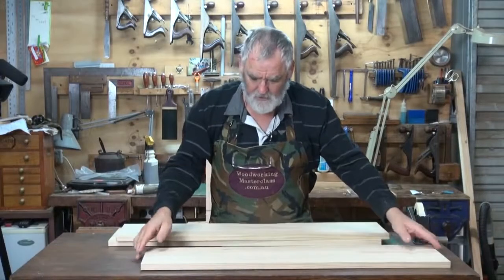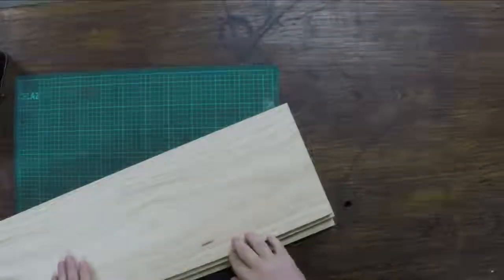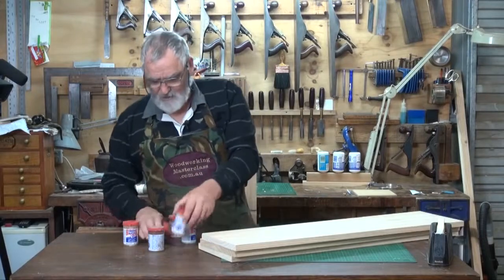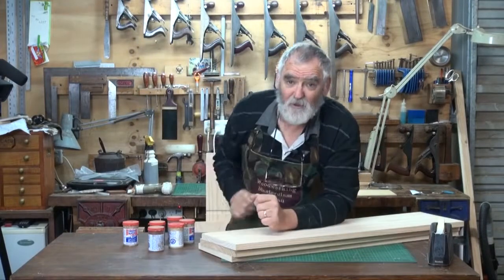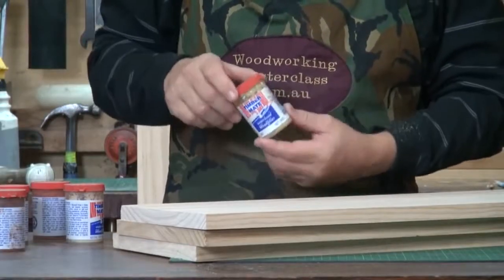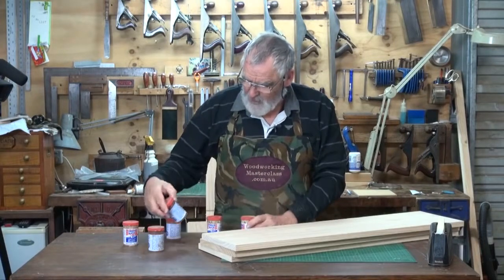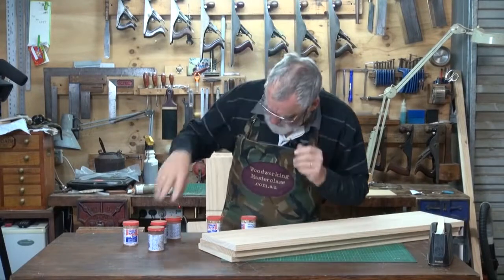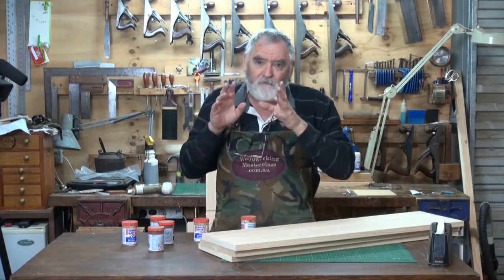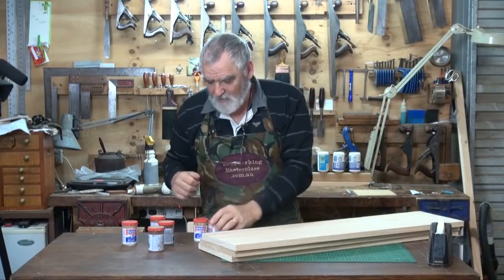Where's that gum vein? There we go. This one here has got a bit of sap around it and it's about two mil deep. Just get some putty. Now there's a whole range of different putties and they're called by the name of the timber, but in my experience they don't match the timber they're called after. What you have to do is mix them. They've got a natural which is a white base, so you can darken it. I think there's an ebony here — so I've got a black and a white, and whatever colour I'm using, I can alter the lightness or darkness by mixing in the light putty or the dark putty.